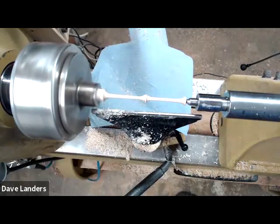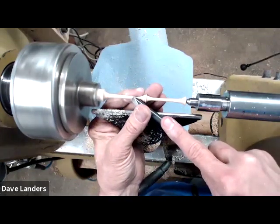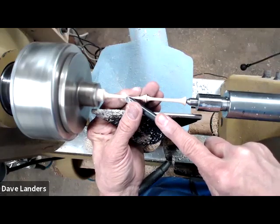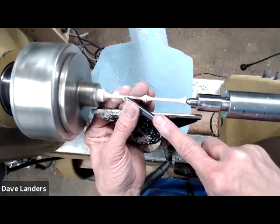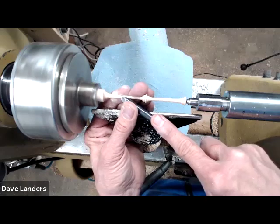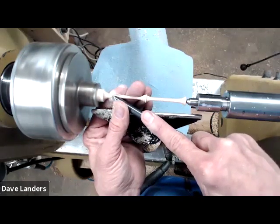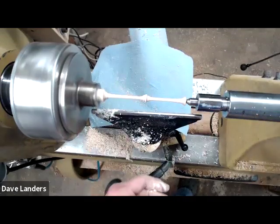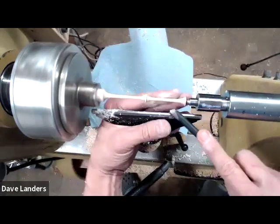So in the spirit of practice, one of the things that I like to do occasionally is get out my skew and just kind of get rid of some of the bumps and ridges that I've left with my gouge. This planing cut is probably the simplest cut you can make with a skew. And to me,